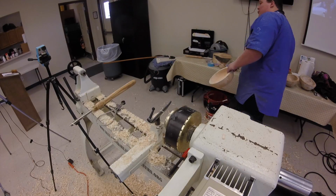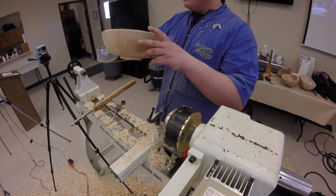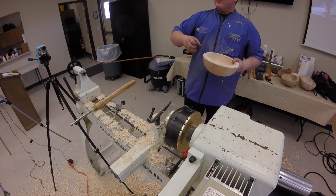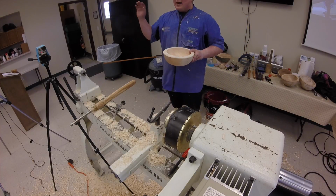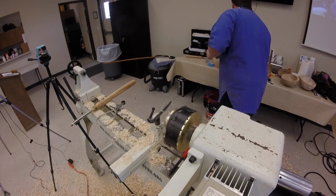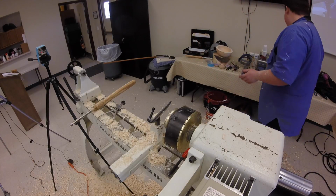Another method is to weigh it. I actually have a paint scale. It measures in grams. It's really, really precise. And you weigh it each time, maybe write it on a slip of paper, and you're going to see it start losing its weight from the moisture evaporating out. And when it goes even or level and stops losing weight, it's lost as much moisture content as it can get, and that way it's dry. Or you can just give it a year and say good enough. That's kind of what I do more or less.